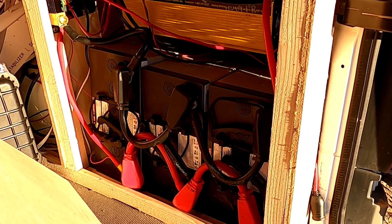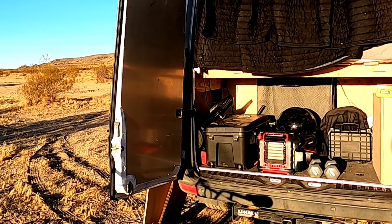So where does that put us? Well, I put in an AGM system. AGM is a type of lead acid battery — it stands for absorbed glass mat. This basically means the cells won't leak; all the liquid is contained within glass mats. This allows them to be mounted sideways, which is really good for space savings. Make sure to check with your manufacturer — I checked with Sun Extender on these packs to make sure they were okay to be side-mounted. This saved a good six to eight inches of my garage space. I have 325 amp hours of AGMs, which correlates to roughly four kilowatt hours — over double that of the AC200. However, it tends to feel like a lot more, and I'll get to why in just a moment. Now, you might be asking why I didn't go with lithium. Well, I intend to. However, the AGMs were already part of this van when I got it. I removed them to try the AC200, it didn't work out, so ultimately I ended up putting the AGMs back.